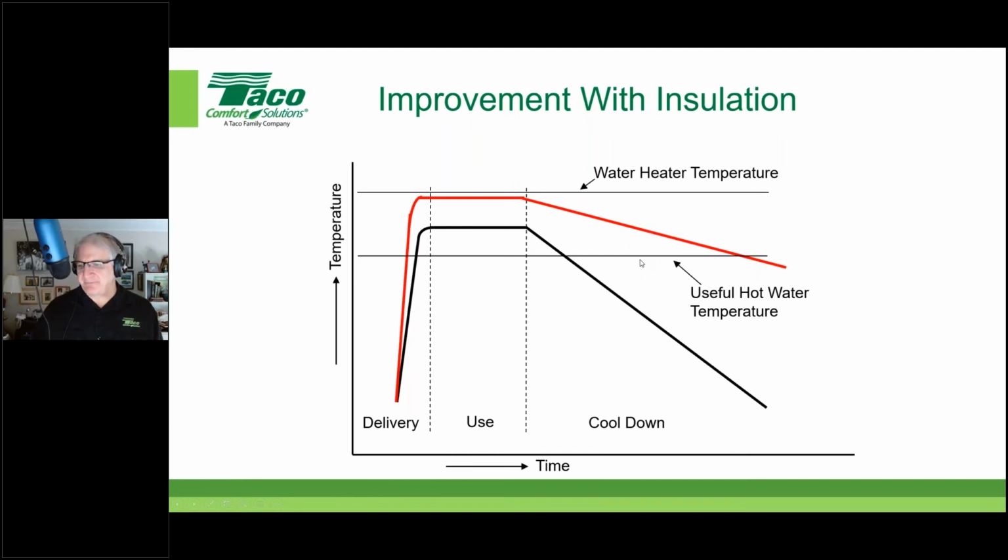It's still there. So if you combine the hot link plus E, 0.33 GPM, 5 minutes on, 10 minutes off with the smart plug, with insulated pipe going to at least as far as that farthest fixture, obviously, you're going to see a great enhancement of the hot link plus E's performance. It's going to work a lot better, a lot quicker, and a lot more efficiently. Other than that, why do it, right? Sorry, inner wise guy coming out. All right. Very good.